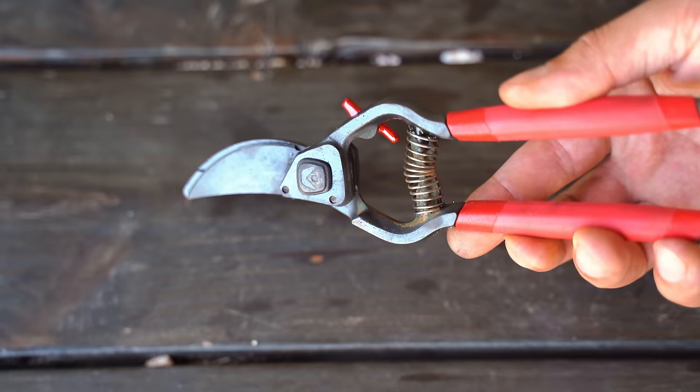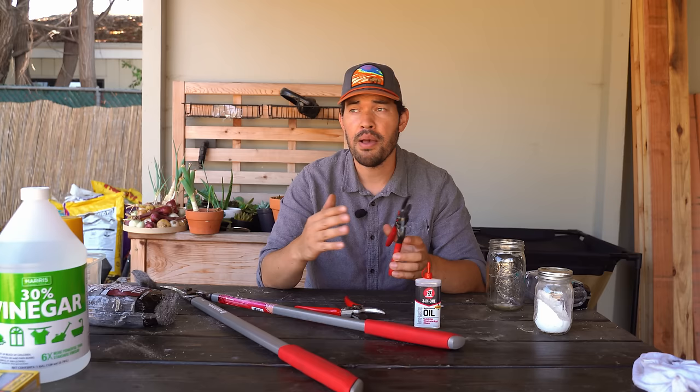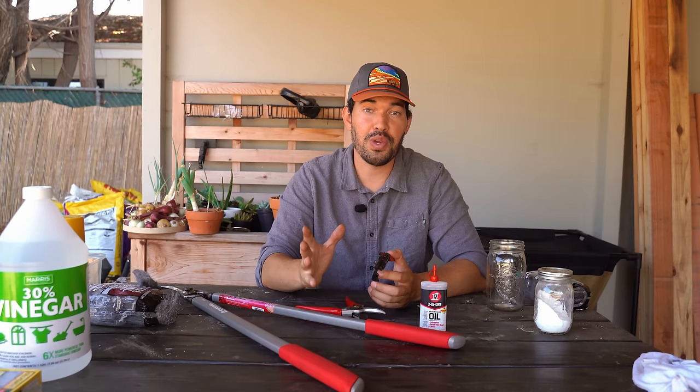Two different ways to bring your tools back to life — buy quality and then preserve it for as long as possible. You've got that baking soda and water paste for the simpler projects, and for the more serious ones it's vinegar and salt at a 16 to 1 ratio — about 12 hours, maybe up to three days for the seriously rusty ones. Then scrape it off, hit it with some 3-in-1 oil as a lubricant and protectant, and you're good to go. Thanks to 3-in-1 for sponsoring the video, and until next time, good luck in the garden and keep on growing.